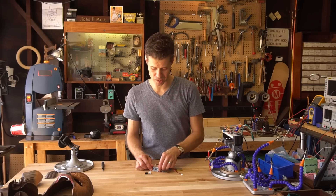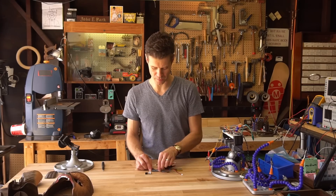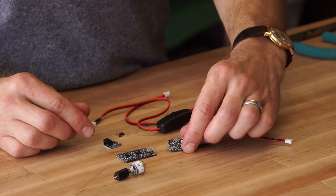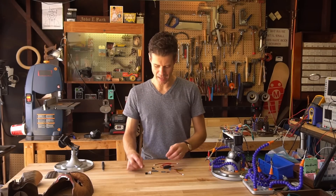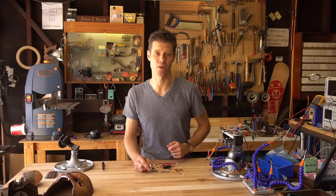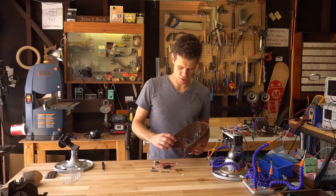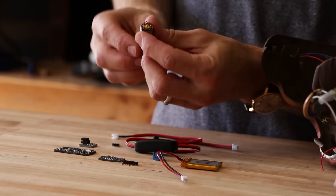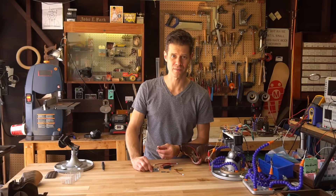This is the Audio Effects Mini Soundboard — this is going to hold all of our sound effects and be used to trigger them. We'll power it with a LiPo battery and battery backpack, and we'll use this little Class D amplifier to power the speaker, a power switch to turn this whole thing on and off, and a multi-position selector knob that'll be used to choose from the different sound banks on the board. When the jaw opens and closes it's going to flip one of our switches, which in turn will run through the selector knob and trigger one of the multiple banks on the sound effects board.